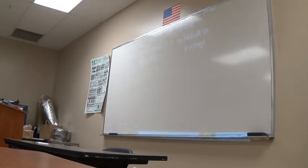They're sensors. I think yesterday I showed you guys the electric expansion valve and where all those PTCs are located. And this gives you a real-time temperature display. It shows you what's the current temperature in the box and what's the set temperature. It flashes between the two. There are 7 little buttons here. You can use these buttons to program whatever temperature you want, change up and down.